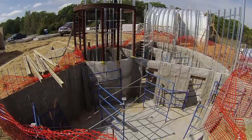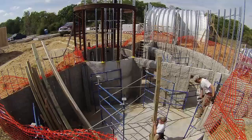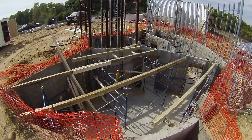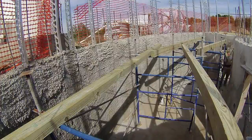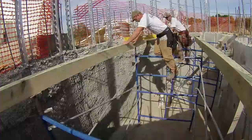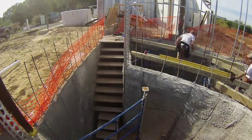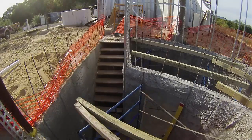The cost of the 4x6 beams was also a surprise and not included in the quote. They used a level and adjusted the feet of the scaffolds to level out the 4x6 beams between the walls. At one point they were adding a piece of ¾-inch board — I didn't understand why, so I went up and asked them. It turned out they just misread the plans. We straightened it all out, took it off, and leveled the beams to move on.